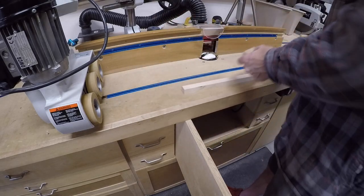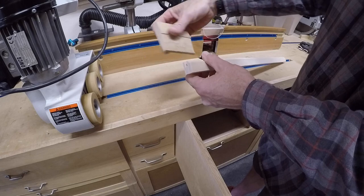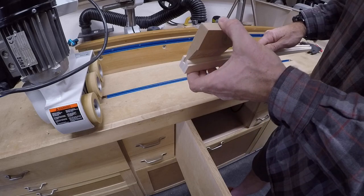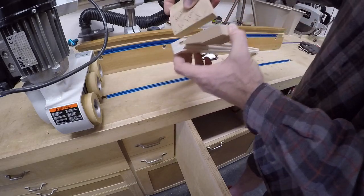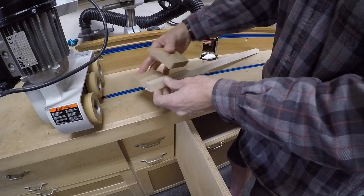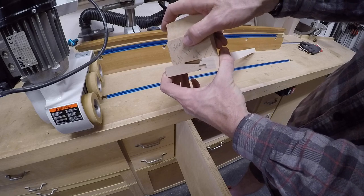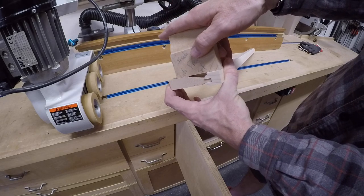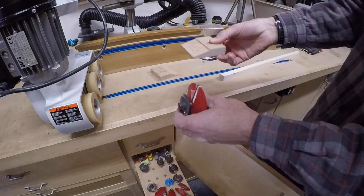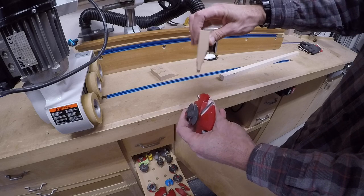Now, if you don't want that, you have to use what's called a back cutting profile. That profile is going to allow this piece to sit in there and be essentially sandwiched in. You see how it's shallow there? And then let me come over here. You can see how it's lower, almost flush. It's all about your personal preference. It cut that profile in one go.